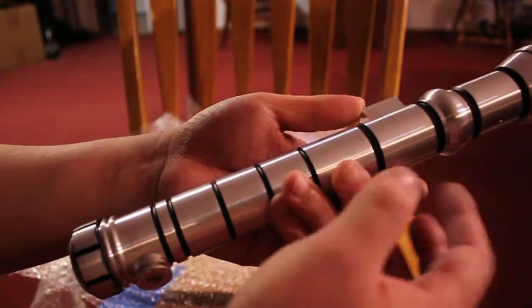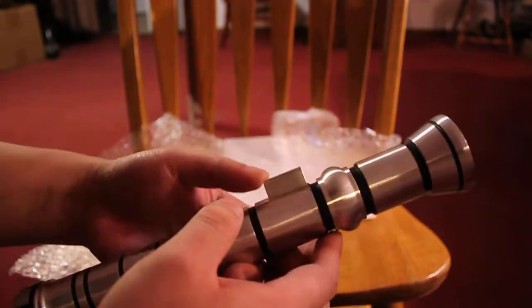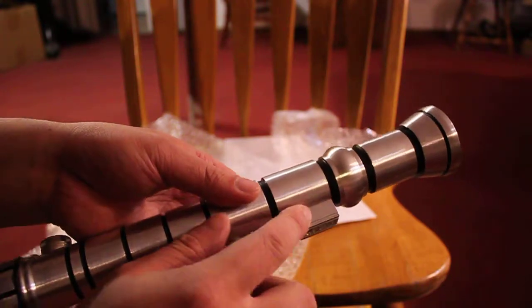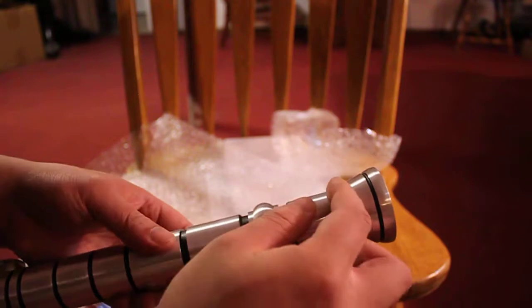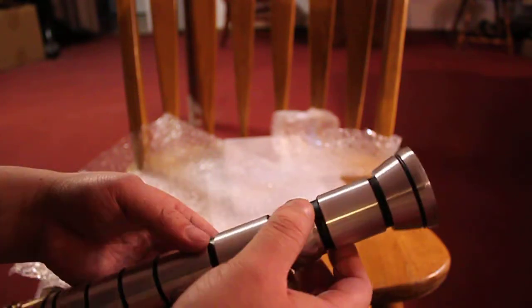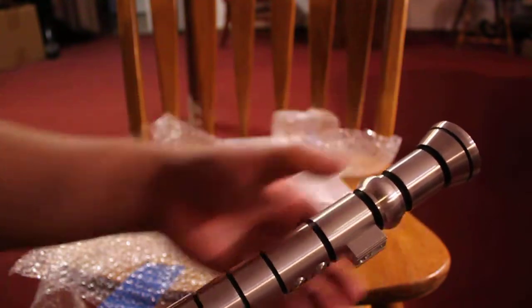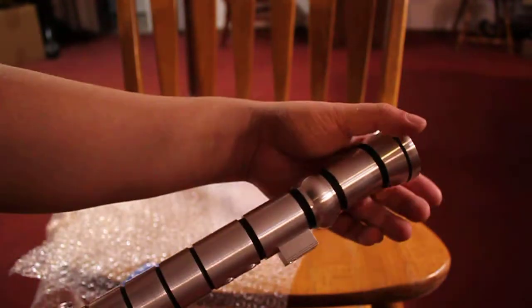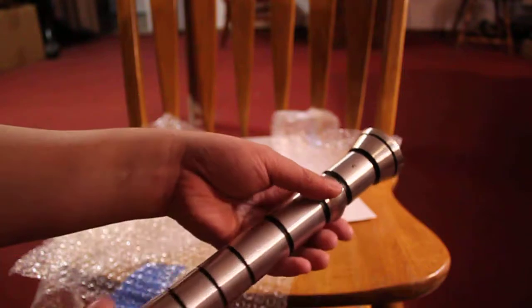The finish, from top to bottom, appears to be media blasted. As you can see, the grooves have these little bumps, so these were probably media blasted and then anodized. So originally it's media blasted, then anodized in black, and then they sanded the whole thing down to be nice and smooth, as you can tell from the brushed look.